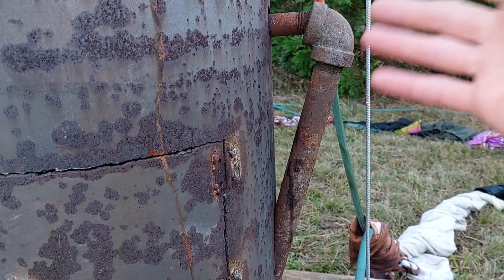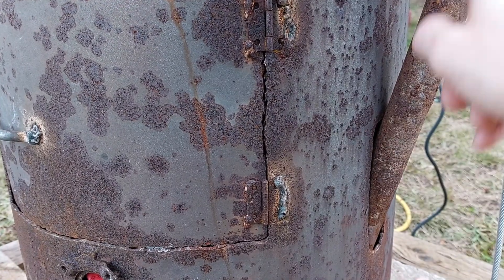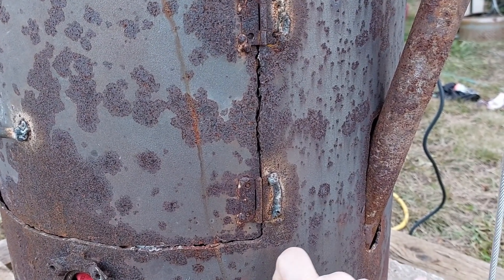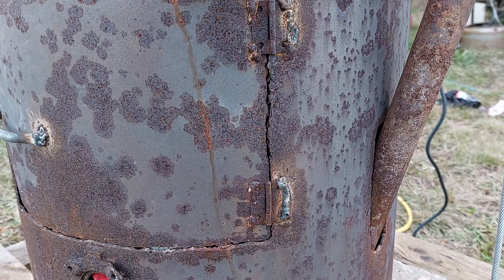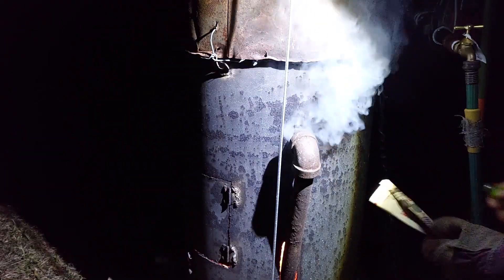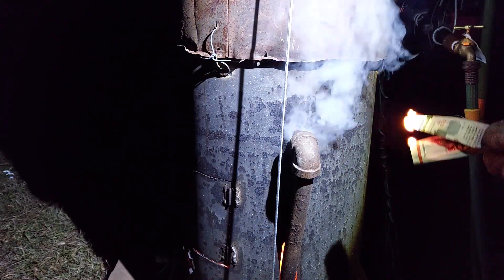This gas is a combination of methane, hydrogen, and other gases. It can be funneled into an engine and it'll run from the conversion of wood to charcoal. Those gases come down through this pipe and can be burned again in the bottom of the heating system. If you look in here, you'll see the wood gas burning in the bottom of the stove. If I open the door, it doesn't draw it in as quickly. So from the charcoal-making process, we're also burning those gases in the bottom — it's a very efficient system.